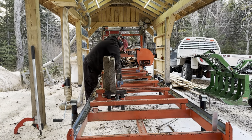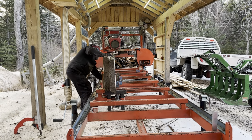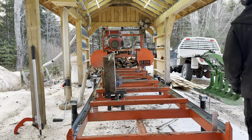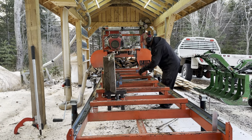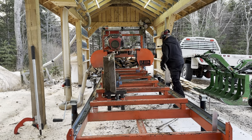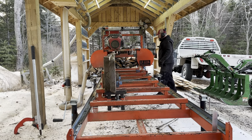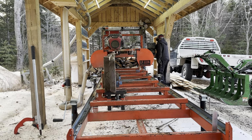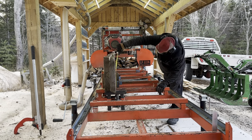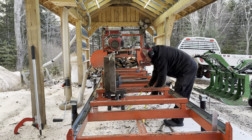And remember, I said that my backstops were perpendicular. It's not exactly critical either that this cut is straight. These boards have to be jointed before they get assembled as a tabletop. So remember, she's not getting the finished product from me. She has to create the finished product from the rough stock that I give her. But I'm trying to save her a step at least, and if I give her one square edge to work from, she can run it through a table saw or a jointer or whatever.